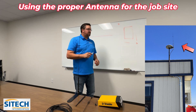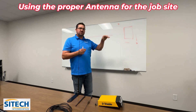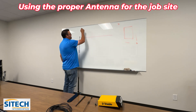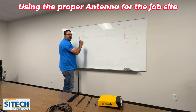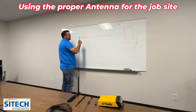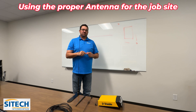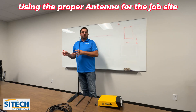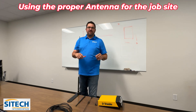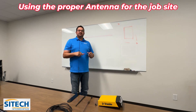Here's one thing that might affect you: this antenna sends out such a strong signal that when machines get up close to it — whether it's mounted high or low — the signal is so strong that it's almost what I call screaming at your machines. You may have an older machine with an older radio and a new base, or vice versa, and it all plays into how that signal gets to your machine, even if you're picking up 17 or 18 satellites.